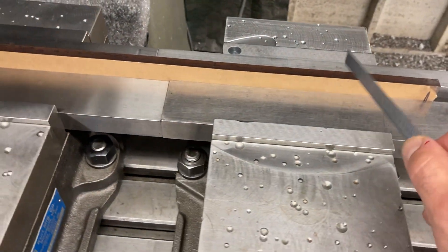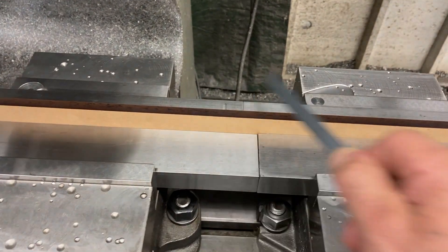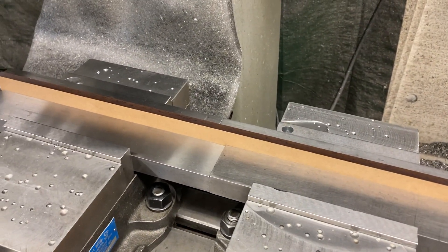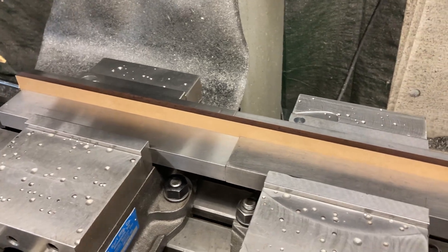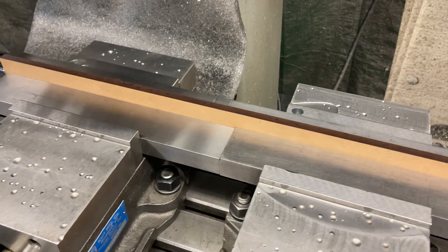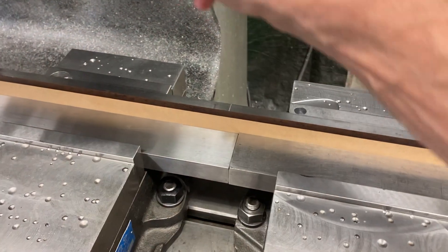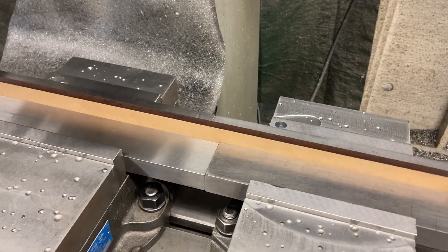If I held it here and here it'd probably be fine — how much deviation can you get between the two vise jaws when it's less than six inches? But either way, this is just the way I do them. Anything long where I have to do holes on the ends, aluminum parts, whatever — I just like having that solid jaw to bank up against to keep that part straight along the length, or as straight as possible.